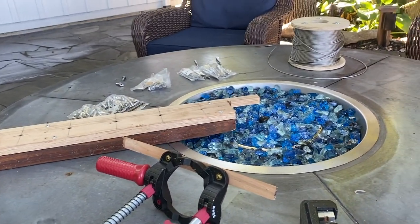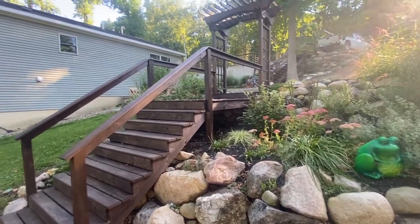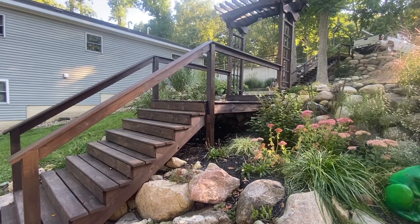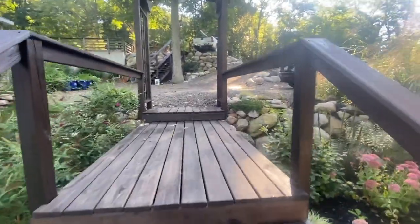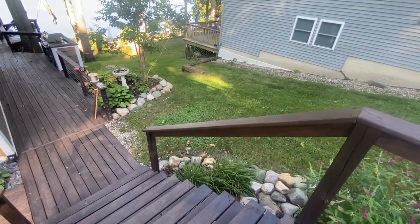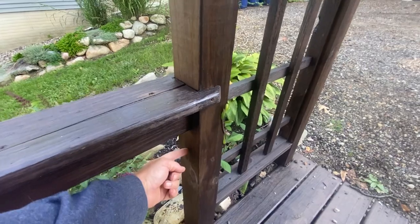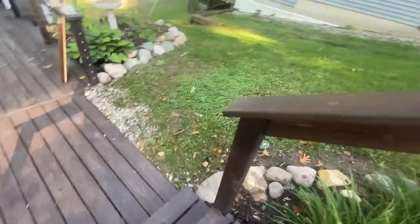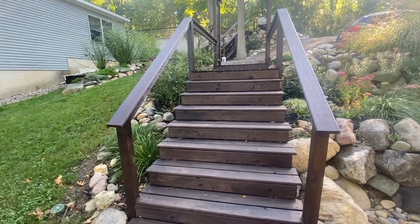So these are basically your components — nothing more than that. Now I'm going to show you how to put this all together. These are the actual steps we're going to focus on today. As you can see, it's all ready for the cable — I've pre-stained it so we don't have to worry about getting around all of the cables. What I'm thinking about here is where I'm going to start the cable from. On a staircase like this, I typically want the cable coming from up top. I'm going to use one of the lag screws and lag into here, come through, drill the holes, go down, drill the holes on the steps, and then tension right here at the bottom.